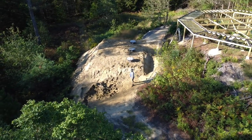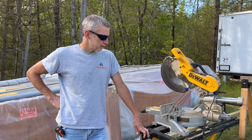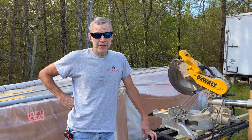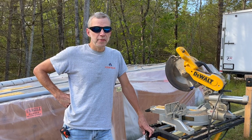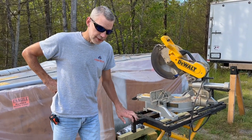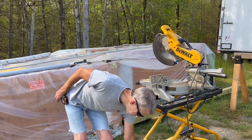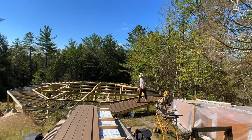Good morning. We are going to start sawing the composite boards to make the deck today. We borrowed a saw from a friend, and every time we tried to turn it on with our solar system it would pop a breaker. This worked the same with our friend who has the exact same inverter and solar system as we do. This saw turns out has a huge inrush current and it will pop breakers. So I ordered a soft starter for it. Very simple — you just plug the saw into the starter and plug the starter into the solar system outlet. It reduces the inrush current. It takes two seconds for it to spin up to speed, but it enables it to start and run.